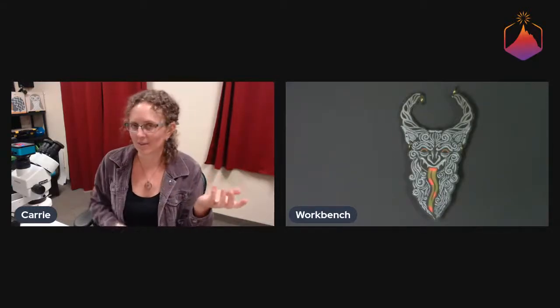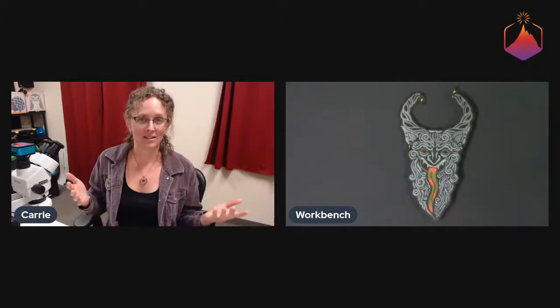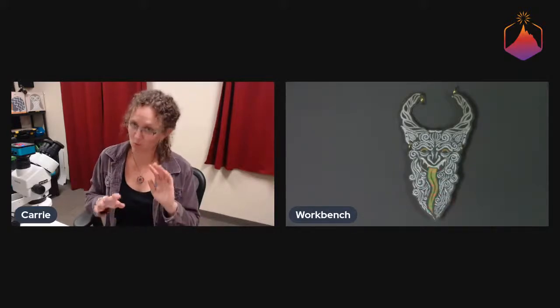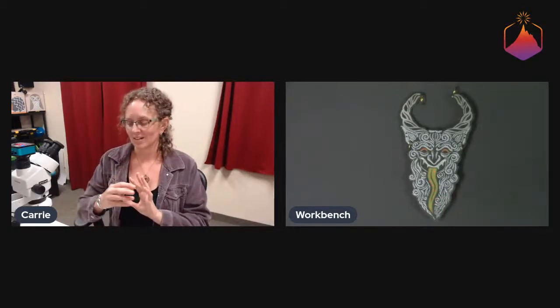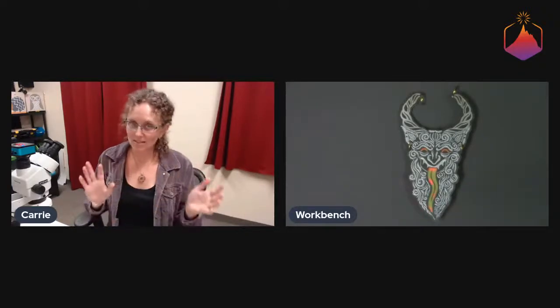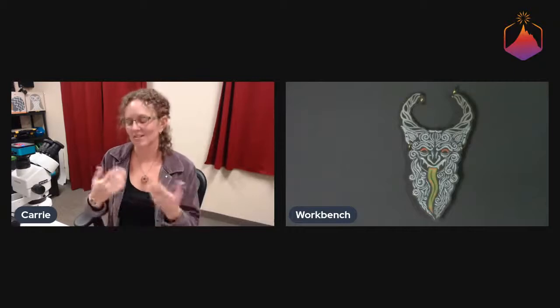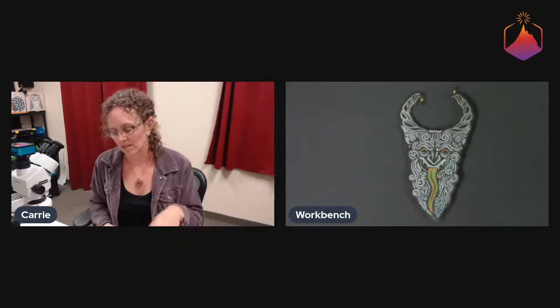If you haven't seen it, you can look it up on our website. It is a rearing unicorn with "fuck you" written in LEDs in cursive script. So you can't change the message. It's just one message that is permanently written in 100 plus 0603 LEDs. But it's kind of funny in that we have a little semi-opaque piece of acrylic that goes in front of it, so you can't see the LEDs until you activate it, and then they shine through, so it's a little bit of a surprise for people who haven't seen it before. And it's either capacitive touch based, or you can get the big red button kit.